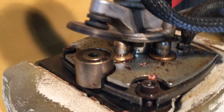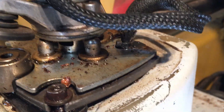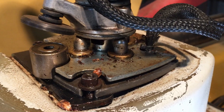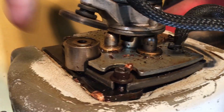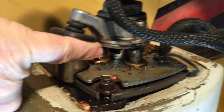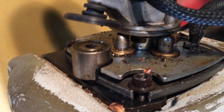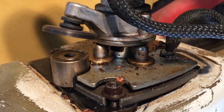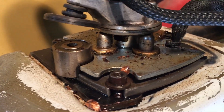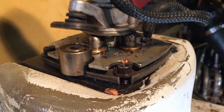Here's our issue up close. As you can see, the oil's all leaking from the plungers here. You can see the meniscus right there between the plunger and its little brass housing — the oil is actually leaking up around the plunger itself. So we will be completely disassembling this and replacing all of the seals in this pilot valve.